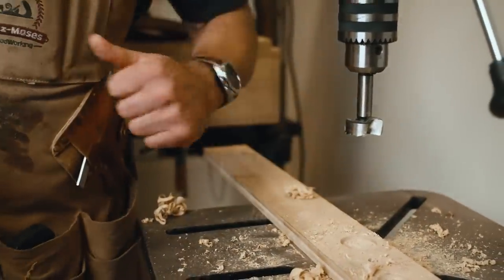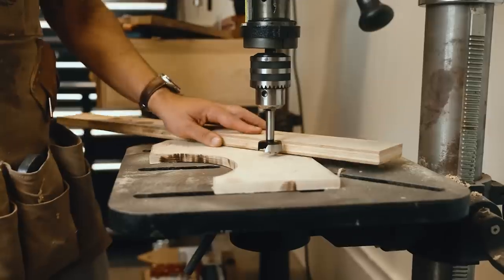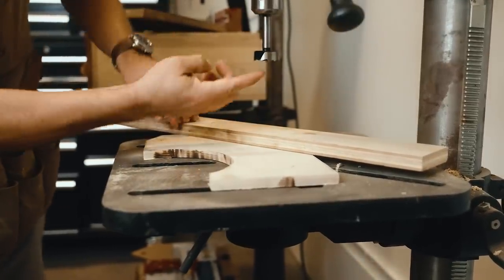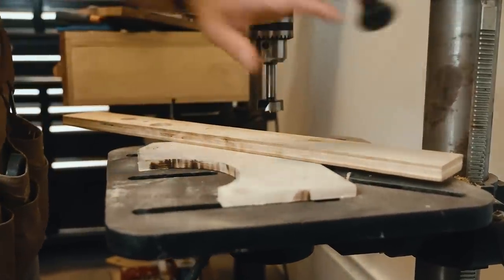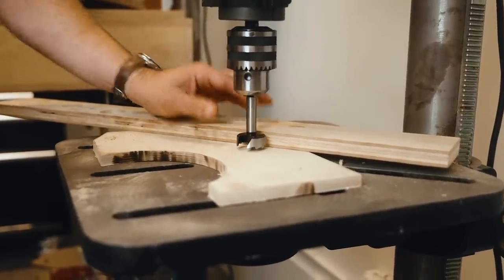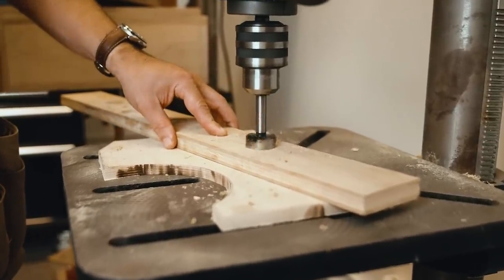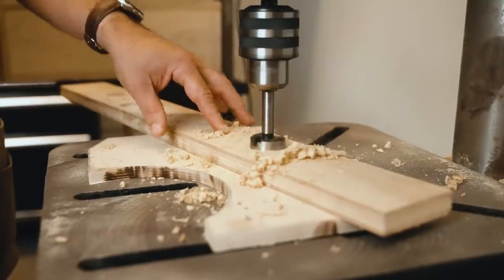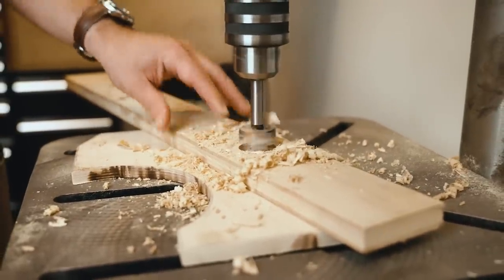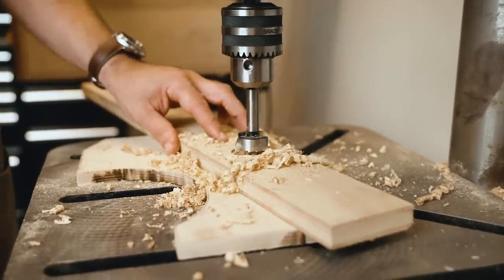Let's talk about how to drill a through hole without getting any tear out. You could use a backer board, but that's not always possible. What you want to do is drill just until the spur — that little tip — comes through, then flip your piece over. Set the depth stop on your drill press so only the spur comes through. Use proper technique at 500 RPMs. If the bit freezes up, stop it; if chips build up, clear them out. The bit won't be hot because we're running at proper feeds and speeds.